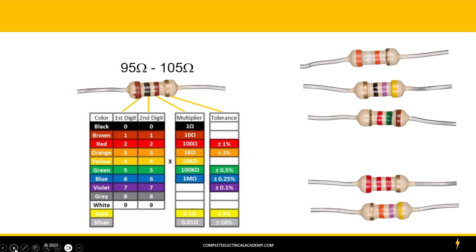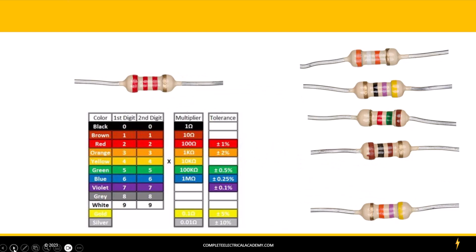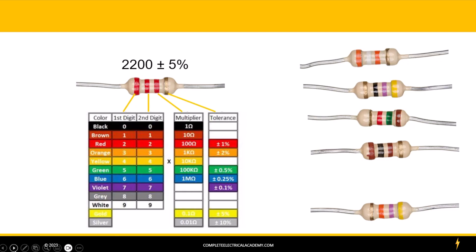Let's take a look at our next resistor — it's three red bands. Our first band is red, red equals 2, so that's our first digit. Our second digit is also a 2 because it's a red band, and then our multiplier is a red band. So you can multiply this by 100 or just put two zeros down — it's a 2,200 ohm resistor. Our tolerance band is gold, so plus or minus 5%. 2,200 times 0.05 is 110, so this resistor is going to measure anywhere between 2,090 ohms and 2,310 ohms.